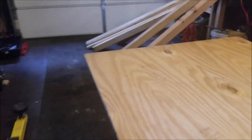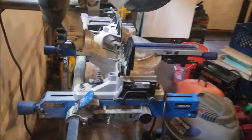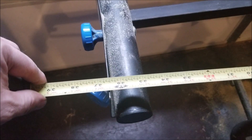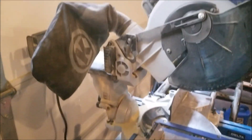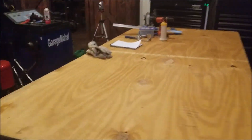Now let's move over to the chop saw for cutting all the 4x4s and 2x4s. I cheated ahead of time and measured out a stop plate at 36.5 inches from where the blade sits, so I'll be able to cut everything in a uniform pattern. Other than that, assembly should be pretty quick putting everything together — and that's it, let's get started!